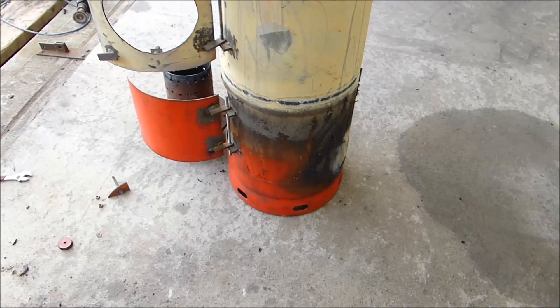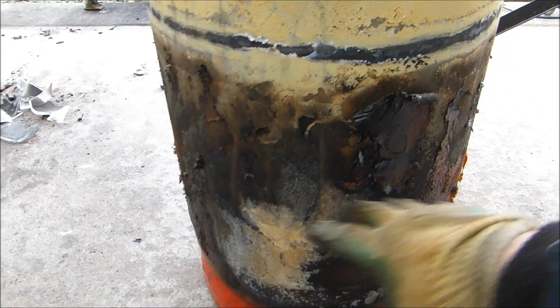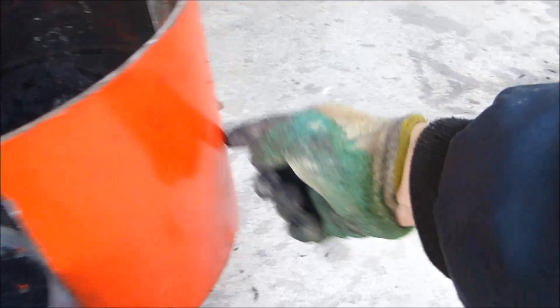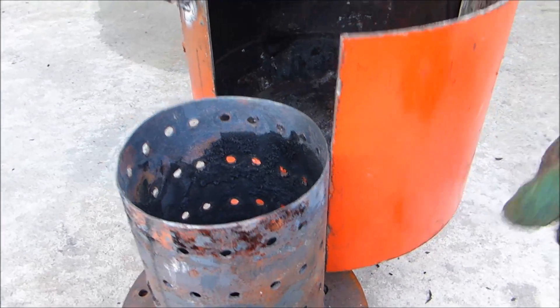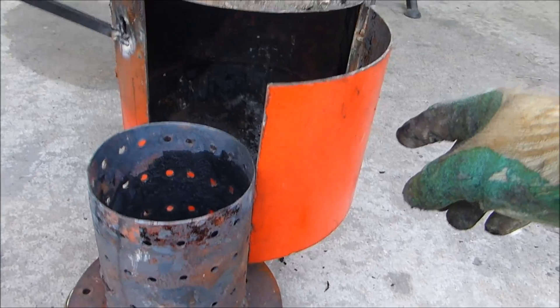Amazing — really amazing. Over a thousand degrees Fahrenheit last night did this. I need to get this crap off it. Down lower, because that's where the division is along here, this part doesn't get as hot. You're getting the radiated heat from the burn chamber, which is fairly immense as well. To use it as a multi-fuel stove, I have to put some sort of air intake here and a handle on this so that when I close it, I can regulate the amount of air. Because if I've got logs in the top part, you want to be able to regulate the air so it doesn't just go like a steam train and burn up all your fuel too quickly.